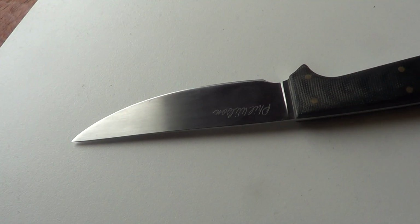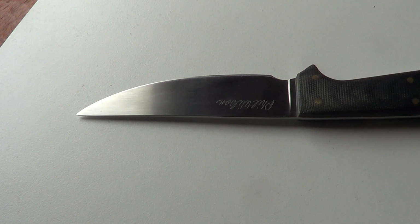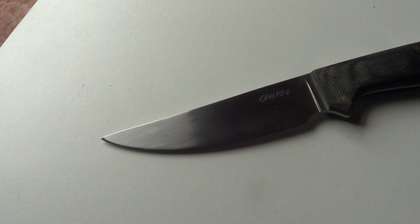One of the main advantages, though, with the thinness of the geometry, is the geometry can continue to cut for a very, very long time, even when the actual apex is maybe rolled down or flattened some. That's just the same physics principle of a wedge. The thinner the wedge is, the easier it's going to keep going into material, and the thicker one is, the more force it's going to take.